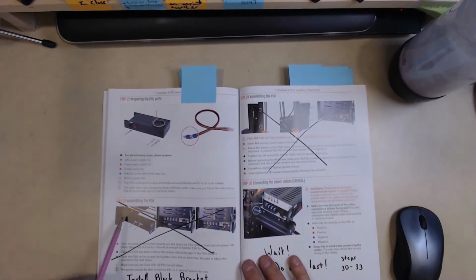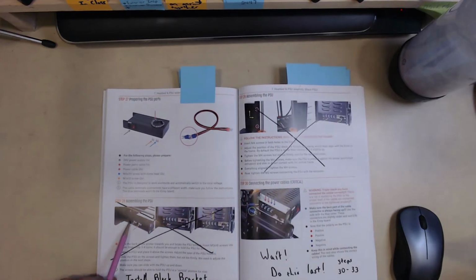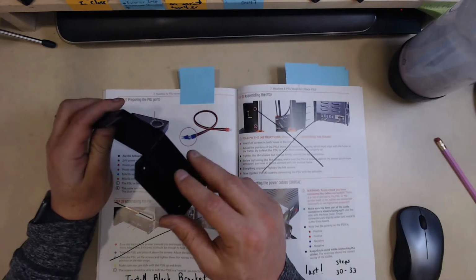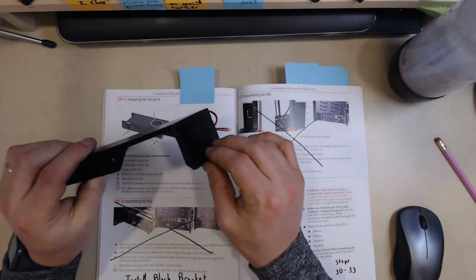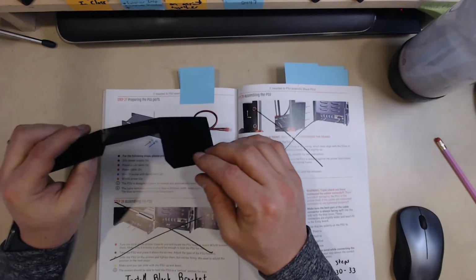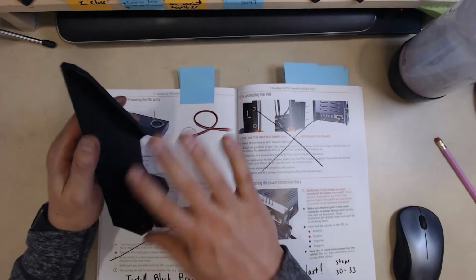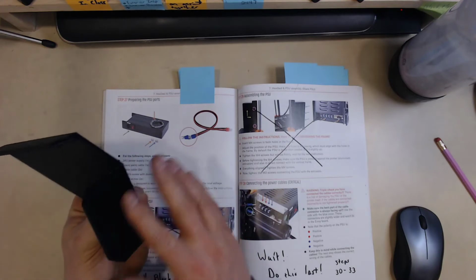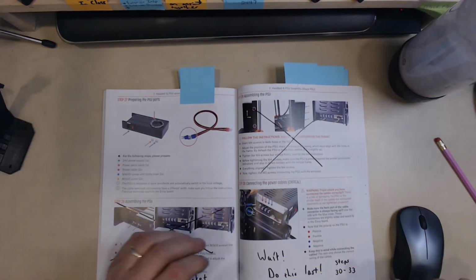Here this is installing the actual PSU, the power supply, onto the machine. Instead, we're going to try and install one of these black brackets. Now, I don't think these printed very well. I don't think this unevenness here was intentional. I think it has to do with the heat bed temperature, so it doesn't fit on well if it's wobbly. Don't tighten it, don't put it on. I'll have to reprint these maybe. My guess is it's not going to fit well, so just feel free to leave it off. It won't damage anything for it not to be there.